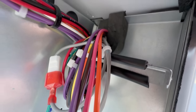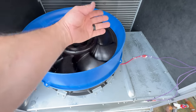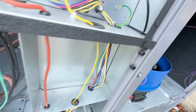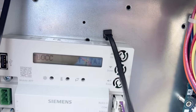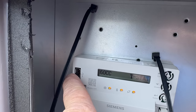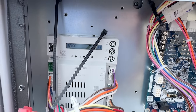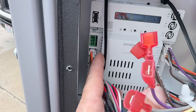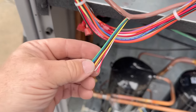This unit did not come pre-wired worth a crap. It came with a wiring harness that goes all the way across — I punched it through that hole and brought it down. I don't like mounting it down low because then wires could get pulled into it. Where I've got it is covered by the outside sheathing, and condensate will drip straight down. Supposedly you can hook up a USB stick and set it up with your phone — possibly proprietary. The mixed air temperature and outdoor air temperature sensors mostly fed into this wiring harness.